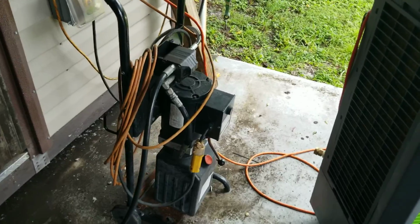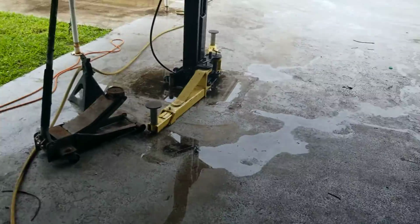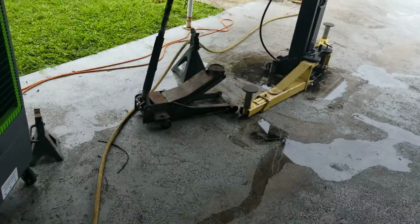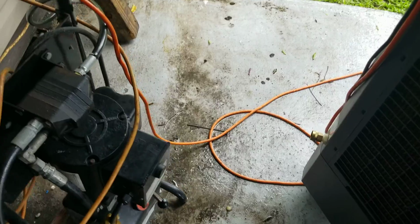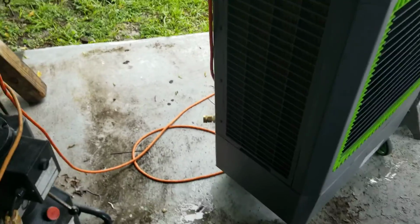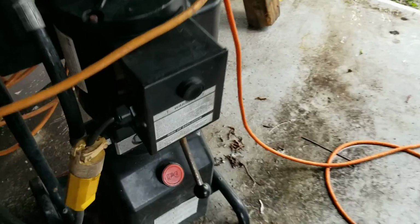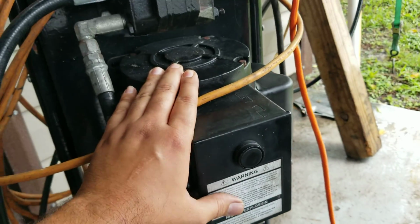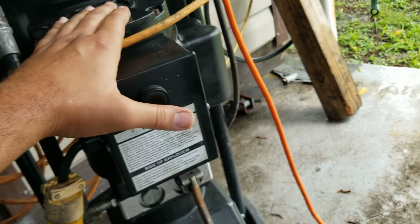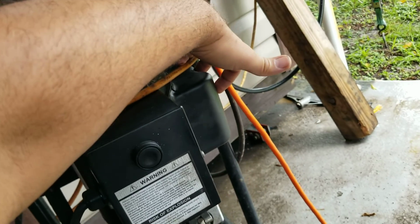And today we're having a little bit of a rant. This is a follow-up video to my Maxjax M6. I had a failure yesterday where I was raising a vehicle up on the lift, and I lowered it on the locks and then I couldn't get it back up because the motor wouldn't work right. I already figured it out. I fixed it. It was the capacitors inside.